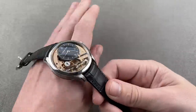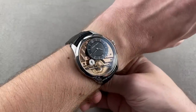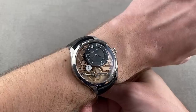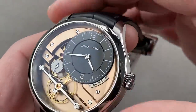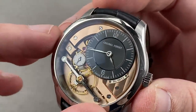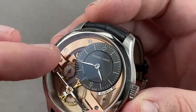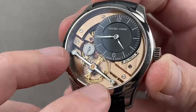Normally Grubel watches are huge — this one is not. It's not excessively broad across the wrist, nor terribly thick. You can wear this as easily as a standard 40mm F.P. Journe, but with Grubel Forsey finishing standards it is admittedly much better finished. The entire movement is gilded, which is lovely, giving a rose gold tint, and we have a solid gold dial cut from a blank of gold and then galvanized black. The balance bridge takes pride of place — it is enormous, anchored on both sides by columns that are black polished, with black polished screws.